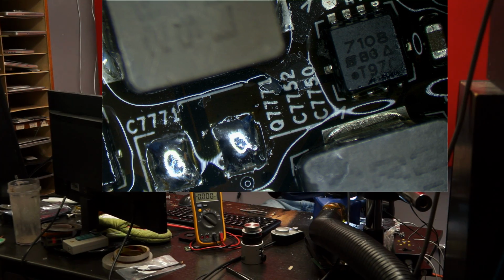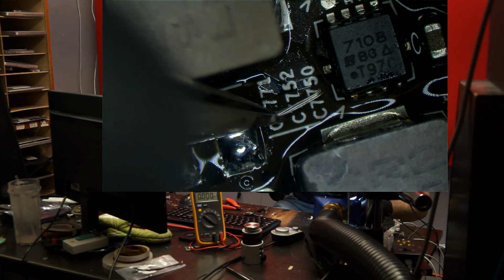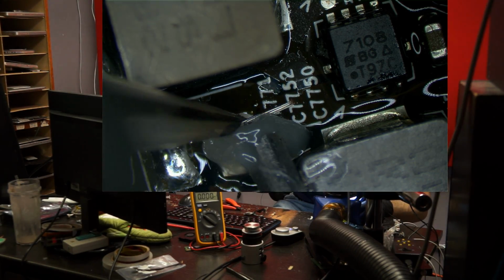You can't screw people. So what I do is, instead of using a tantalum capacitor here, I'm going to use a film capacitor here. It's going to perform the same function, except it's not going to have that issue of over time becoming short-circuited and shorting my MCP voltage to ground and leaking it to ground. Because keep in mind, on a buck converter, on the output of it, that capacitor is there to smooth out the output, but it's also there to act like a battery, to store the voltage. And if it's not storing the voltage, then you run into problems.